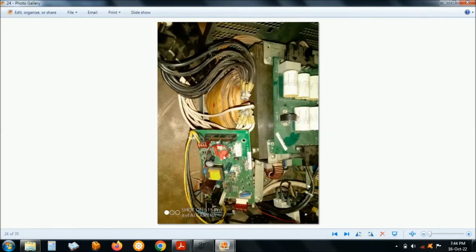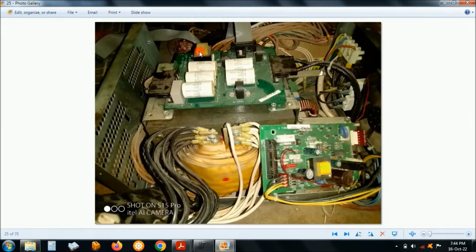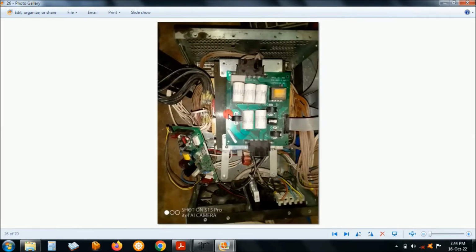This board, I took it out, the filter board. The transformer I used for feedback is this one. So this is the cable output for the filter board. I used that feedback for sensing the output, the AC output, and also sensing the level of the AC output, and also to check whether the inverter is running properly. Okay, using the program. I'll share with you the program.